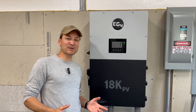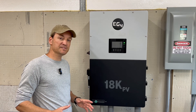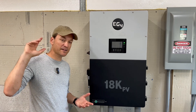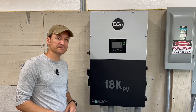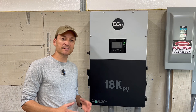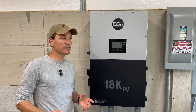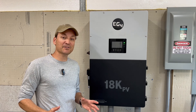There are limits though — we can't run both ovens plus all the HVACs and do everything else at the same time. So we still manage loads, but it's just a lot easier. I'm still using the cellular dongle on the inverter and that's worked great — I've had that running for around 11 months. The actual cell service in the area has dropped twice, but the cellular dongle hasn't had any issue at all. They've come up with a number of firmware updates since I installed the unit. Most would apply to grid-tie and hybrid functions, but they've also come out with a few updates focused around 120 and 240 volt loads, and another firmware update focused around surge — to handle inductive loads better.